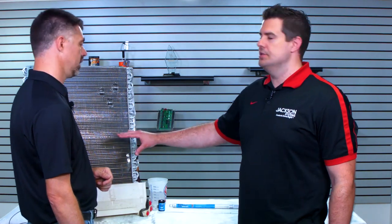So how common is something like this for the HVAC contractor to run into? It's becoming a lot more common in the industry today — we're seeing a lot more issues with aluminum coils getting rub outs and damage after things are running for a while. So it's surprisingly common. What do you think the most common cause is? Physical rubbing between two parts on a coil is probably the most common. Sometimes you'll get an electrical short to a coil and it will actually physically blow a hole in the coil, things like that.